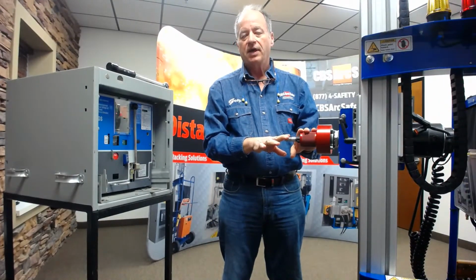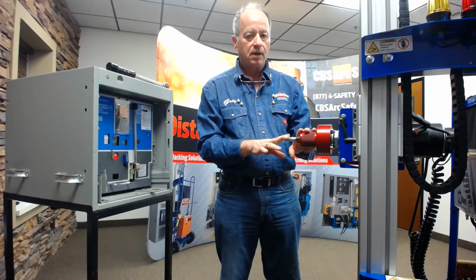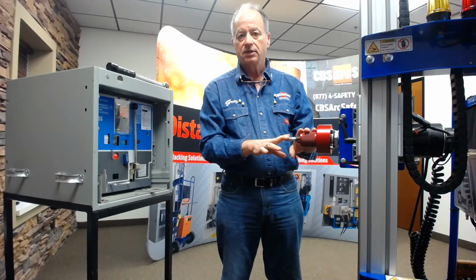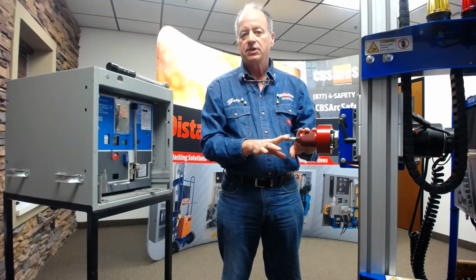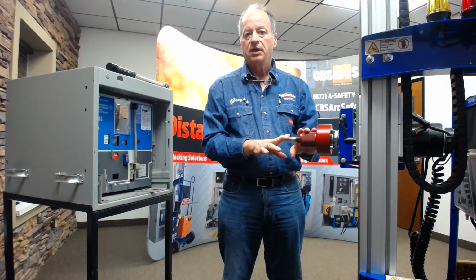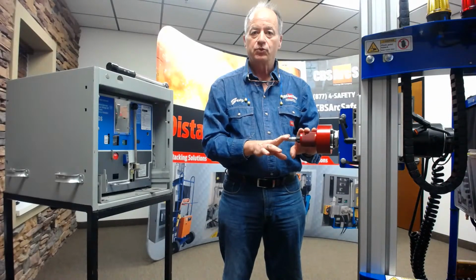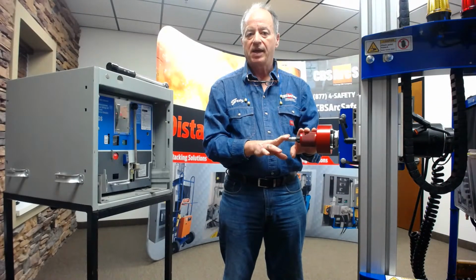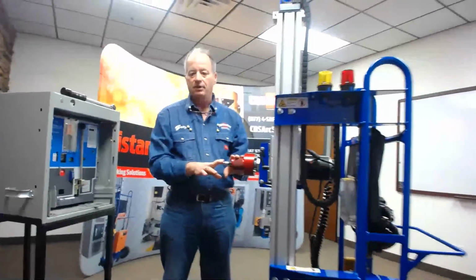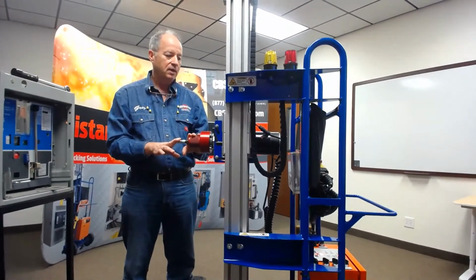As I said, if you've got questions, the maintenance on the system is actually made to be fairly easy. There's a full diagnostic in the manual. The batteries are something we would encourage you to check once a year. The recommended replacement by the battery manufacturers is every 3 years. These are simply 12-volt AGM batteries. They're the sealed 12-volt 8 or 9 amp hour ones that we use. You do have to have the batteries in the system to be able to use it.